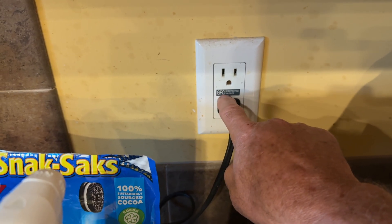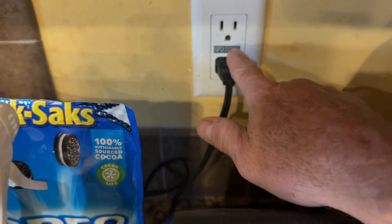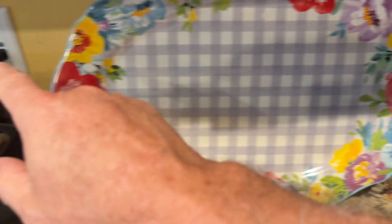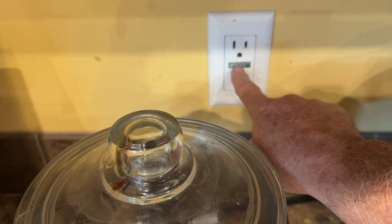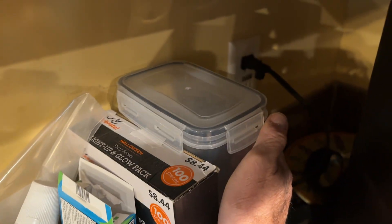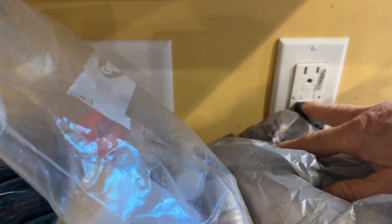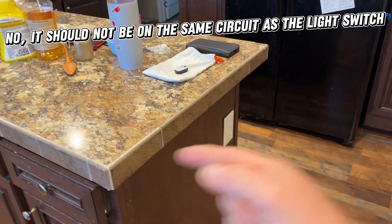It still has a sticker that says GFCI. Now this one over here has a green light — that means this is your primary receptacle. The one without the push button is more than likely run off this one. So if that receptacle trips, this one over here won't work either. The others down the line also don't have push buttons, meaning they're probably on the same circuit. Then there's one more by the light switch that does have a push button, so it's probably on a separate circuit.